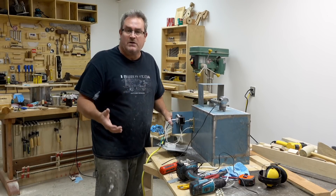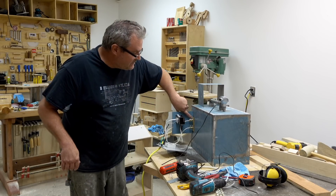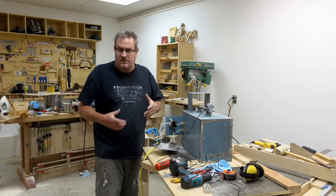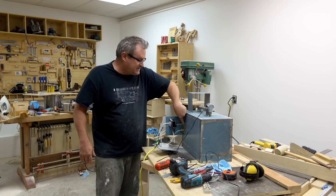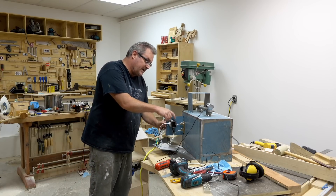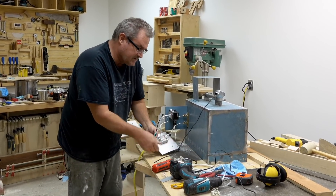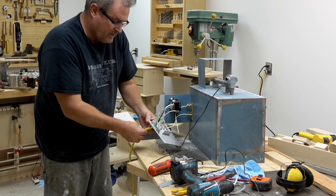I've been putting the equipment in and doing the wiring. I got started by adding connectors to the ends of the elements. To keep those from touching the side of the case, I cut out a piece of perfboard — anything heat-resistant and non-conductive works, even an old circuit board with the copper ground off. I notched it around the leads and stuck it in; it can't come out because it's up against the front panel. I also put in the PID and the switch below it, and added wires to these connectors — one goes to the solid-state relay, and the other to the neutral connection coming in.